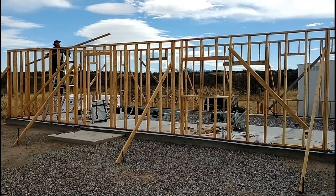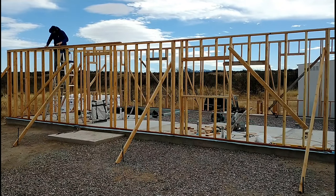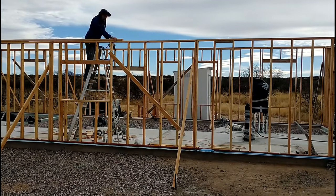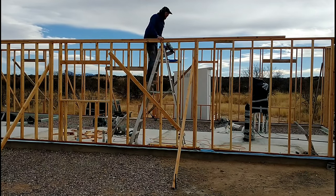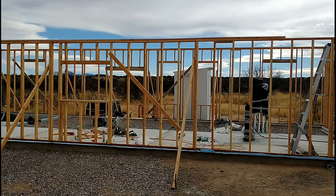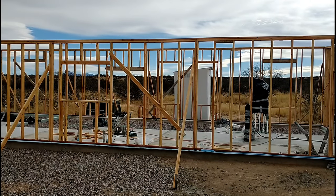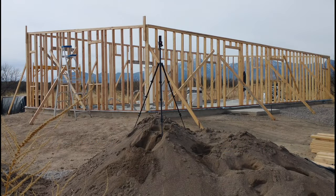The last wall that needed the top rail was the north side of the house, which is the low end. It wasn't very straight originally, but I'd already gone back in right after building it, leveled the top, and put in some spacers. So the top rail went on pretty quickly — it was just a matter of cutting boards, getting the seams offset correctly, and getting it nailed in place.